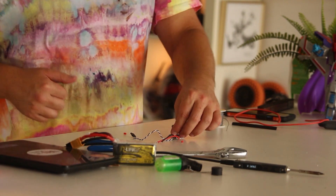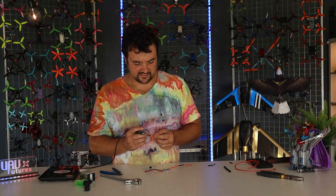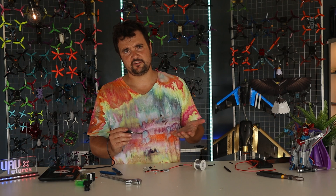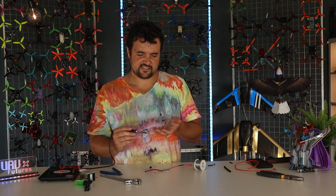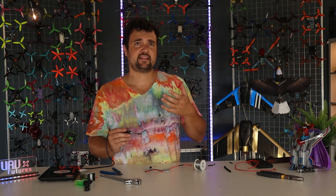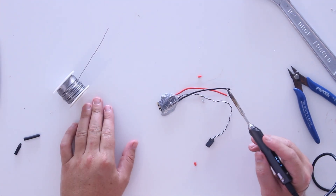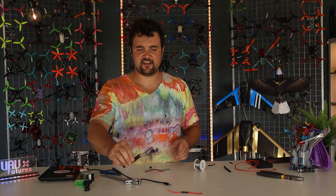The last lesson of today is removing a joint — desoldering. The process is very similar. Put a little bit of solder on the outside of your soldering iron and try to be quick. That lead-tin solder is very good at transferring heat — it's got rosin and flux in there which helps get heat into the joint, loosen the metal, and liquefy it so you can remove the wire. Put it on the joint and look at that — it's already removed and off.